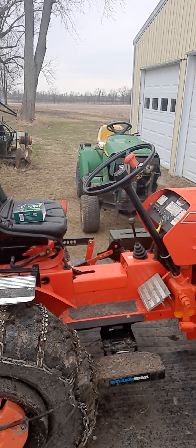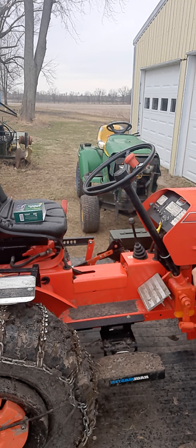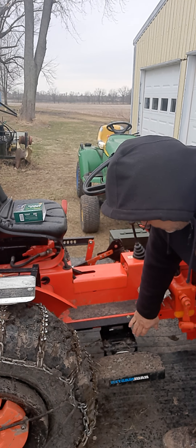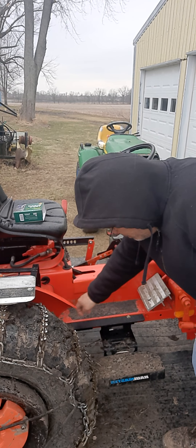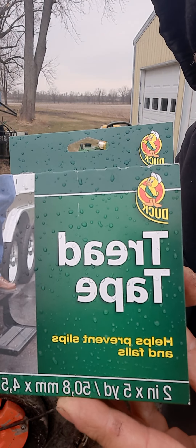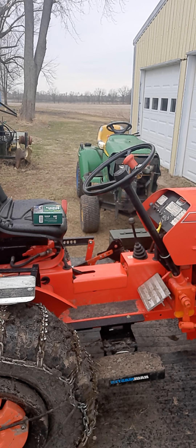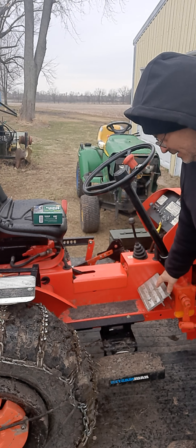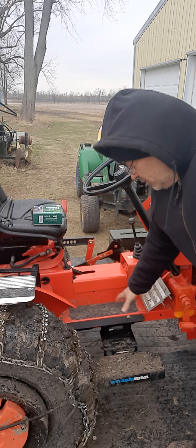The next thing I did was add an extension to the footrest. I just had some angle iron and bolted it to the side where there were already some holes in the frame. Then I found a piece of flat stock and bolted that to it. I bought tread tape at my Harbor Freight store and put the tape on there — real simple fix. I made the pedal larger, and since I made it larger, my foot wants to be over here for more leverage, so I needed to add this little footrest piece.